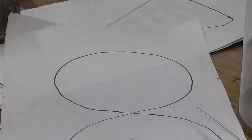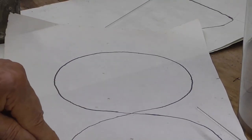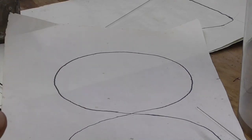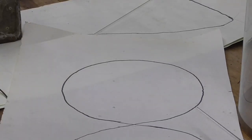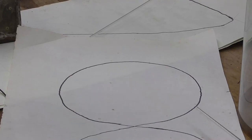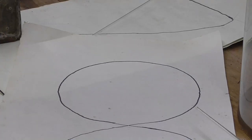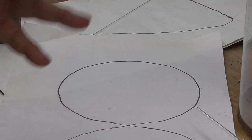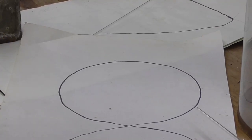This serves two things. The first thing, we want AC on these tubes. We don't want to use DC to light them up. So we're going to use AC, just like in a neon sign, to light up the tube, and an inverter, a small inverter, that'll put out the 5 or 10 milliamps that it takes at the 5,000 volts. This will not be much. It'll be a little small inverter that can be easily built, and there'll be 10 of them, one for each digit. And those will be easily switchable by the 12 volts on the primary of the inverter. Okay?